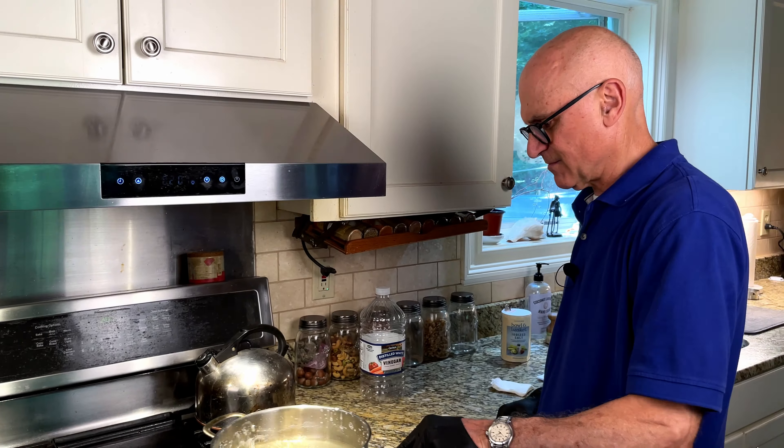It's been about ten minutes. That's pretty good — without touching it, it's gotten rid of probably 80 or 90 percent of the tarnish. You can see the copper showing. To get rid of the rest, sometimes you can get a sponge, dip it into the vinegar, sprinkle on some salt to act as an abrasive, and just scrub it. Once it's as clean as it can be, dry it really well. If you clean it every three or four months, the salt and vinegar will cut through that tarnish pretty quickly.